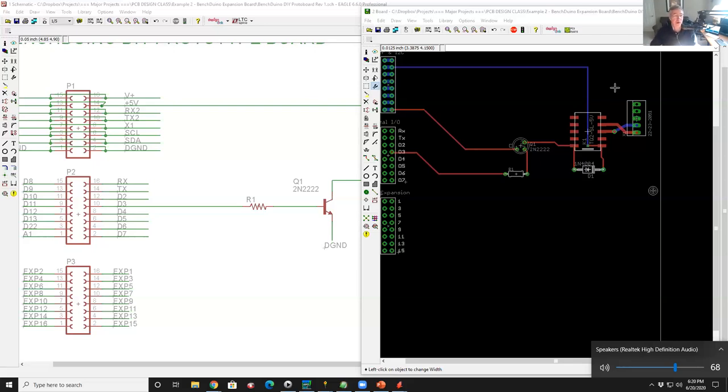Yeah, actually, that wasn't too hard. The 90% of the answer is easy. It's the last 10% that's the hard part. So the easy part is, well, okay, let's start with the obvious thing. Everybody needs power and ground, right? You probably want a reset pin. You want I2C clock and data, because it's only two pins and everything runs I2C, and every sensor out there you can get in I2C.